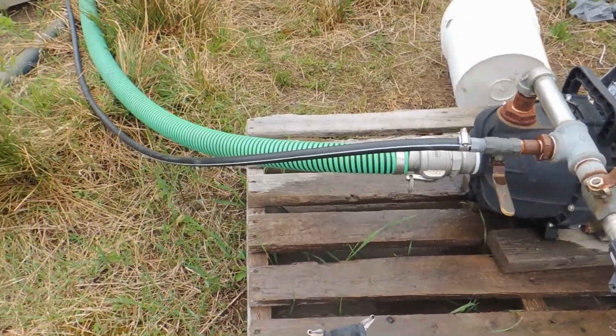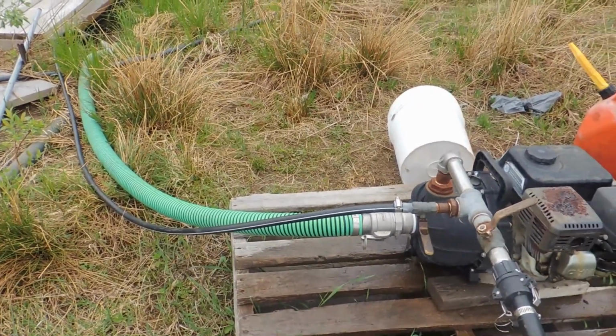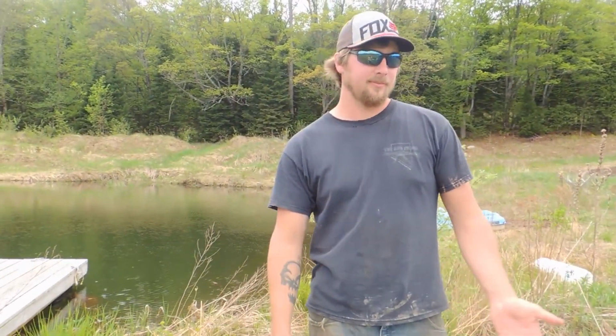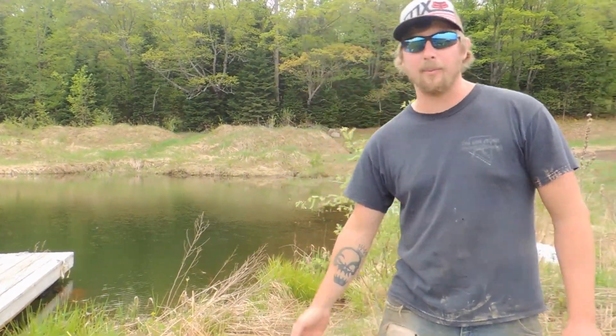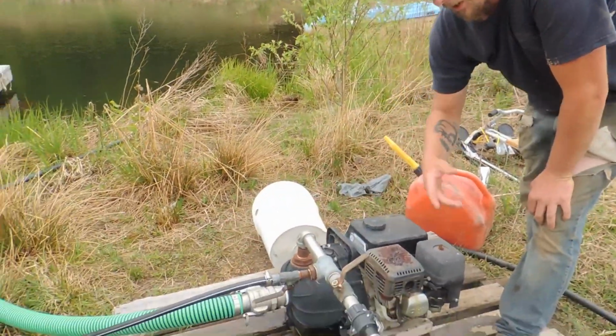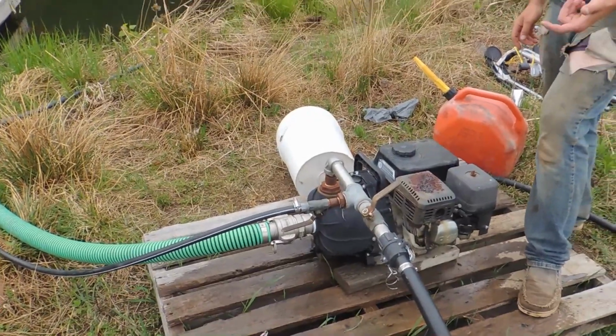And this other black hose was just informed it is a relief hose. It's just so basically you can relieve pressure, or you can rev the pump down. There's tons of ways you can mess with it. Open it up, can reduce the pressure if you don't have a regulator. You can idle your pump down if you don't have a regulator.